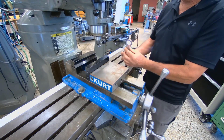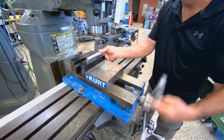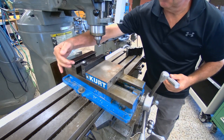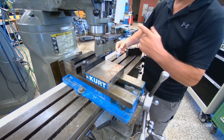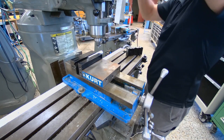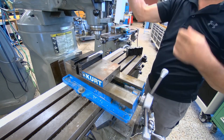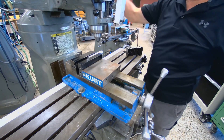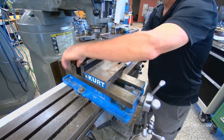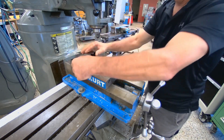In this setup, we're going to hold a round piece accurately. There's a V45 cut into these jaws — put the part in and close the vise. One important thing: this is your movable jaw, and the indent block or jaw should be in the back where the jaw does not move — that holds it in place perfectly. If you want to change speeds, move to the high position on the right-hand side. If you want to stand the part up, change jaws to the vertical direction, drop them in place, and tighten them up.